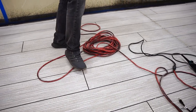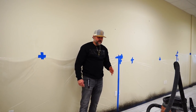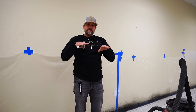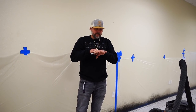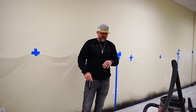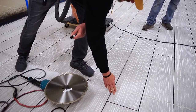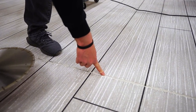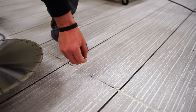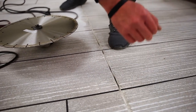And then the last thing we want to do, we always want to re-saw cut for the overlays because they don't bridge cracks as well. They'll crack, and what happens when the slab is moving and hitting each other, right? They move a little bit, the product that's filled in there will flex and start to chip out, and you run the risk of chipping an edge or a chunk out because this whole saw cut is filled. Well, we come back and open that up, and now we have a gap where the slab can move without hitting the product inside there.